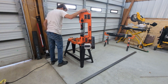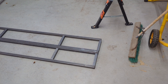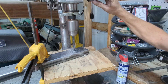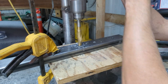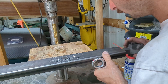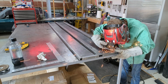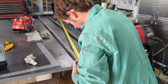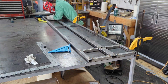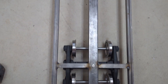The first thing I did was cut all the steel pieces for the frame. The spine of the car uses 1x2 rectangular tube and the rest of the frame I used 1x1 box tubing. Before I welded the frame together, I drilled holes for where the couplers would mount as well as for the truck pin — I made sure to do this before welding since it would be much harder with my drill press once the frame was assembled. I mocked everything up to check the holes were in the correct location, then tack welded the corners and measured to make sure everything was square. I then welded the frame, making sure everything stayed square and didn't twist. I threw the trucks and couplers on it just for fun — this thing's starting to look like a rail car, but we've got a lot more work to do.